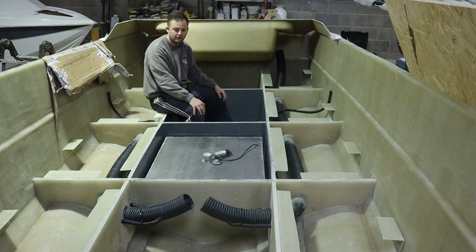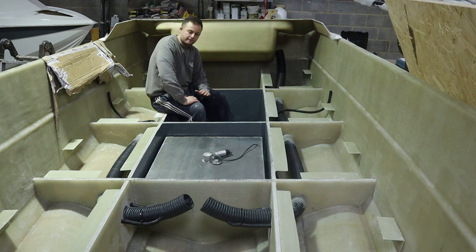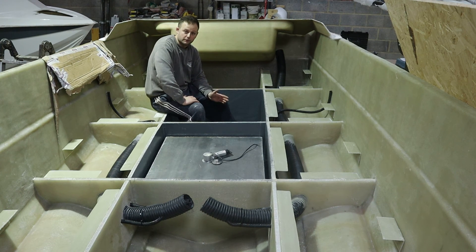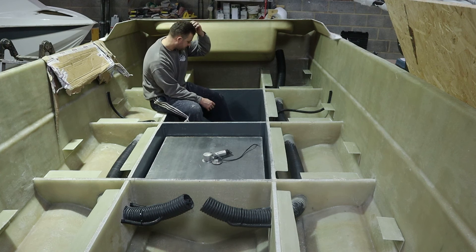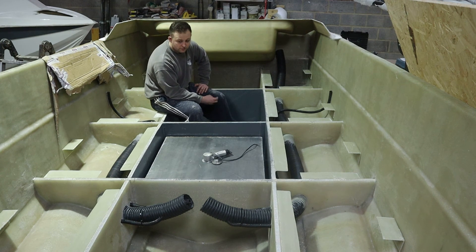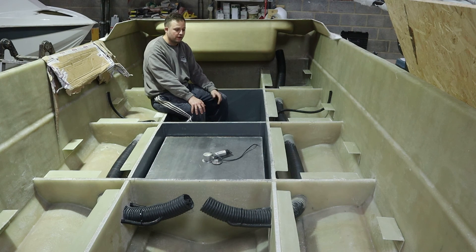After this stage there's not much more to do underneath the deck before we can get the boards in, get them laminated in, and finish that off. I want to check everything carefully — we've got bilge pumps and skin fittings to install, and if they're going to run under the deck it's best to do them now before getting too far ahead. She's pretty sturdy, feels good, and is a bit lighter than last time, so we're trying to maximise speed. All the chines have been stiffened which should give us a good base point going forward.